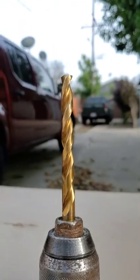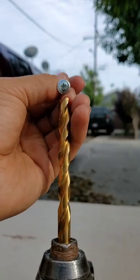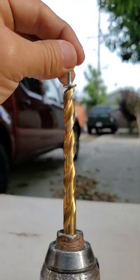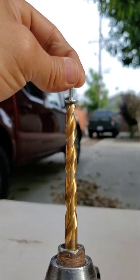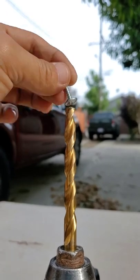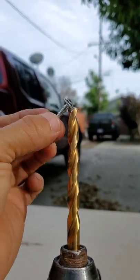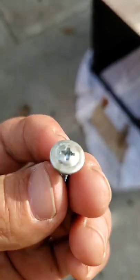What you can also do is get one of these bigger drill bits, make sure the head is about the same size, and just make a little starting point just deep enough for the head to be recessed — that should hide the rest of the screw. Just make sure you use some of these self-drilling screws. This one is meant to go through sheet metal.